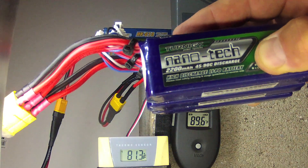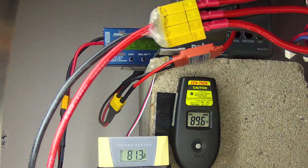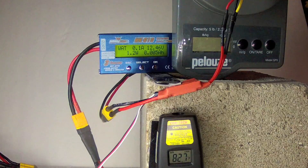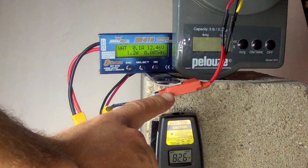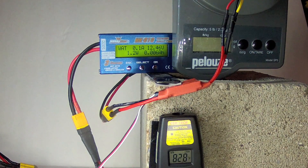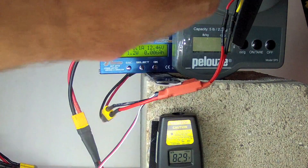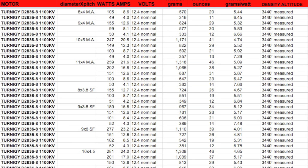For this round of testing, I'll use three 2200mAh 3-cell Nanotech battery packs connected in parallel for a nominal voltage of 12.4 volts. Here we'll be testing the Turnigy D2836 8-turn 1100kV motor with a variety of propellers using the Turnigy Plush 40-amp speed controller. We'll mostly focus on the propeller choices for this motor. To follow screenshots of each of the individual results, you may wish to skip right to the spreadsheet on my shared Google Drive by clicking the link in the description.